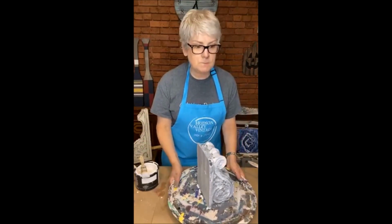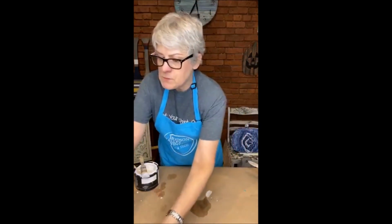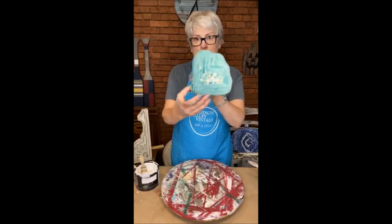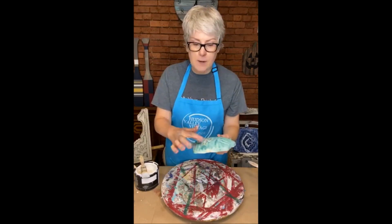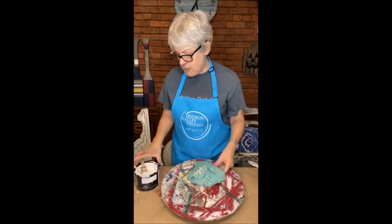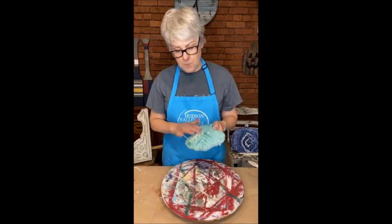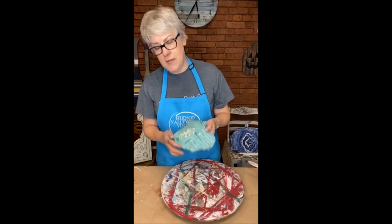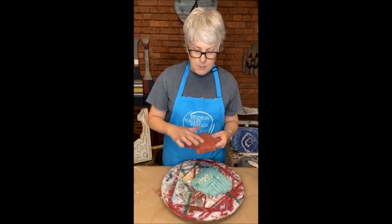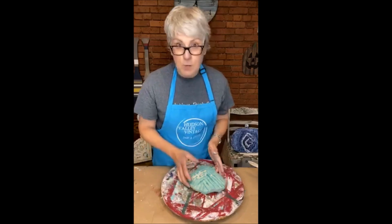All right, honey, you want to take this? Okay. All right. So we're back to our, so look how that chipped. It's actually not a bad thing. You might look at it saying, wow, look how that's not adhering. Well, one of the properties about milk paint that people love so much is that you can get a chippy look. And we didn't do anything to do that. It just does it on its own. Now, Kevin's using a heat gun in the back, which is really high heat. So that will do it a little more than usual. But let's keep going, okay?